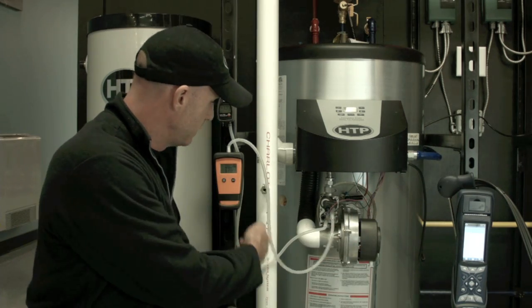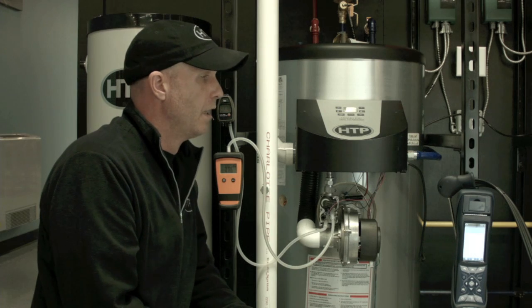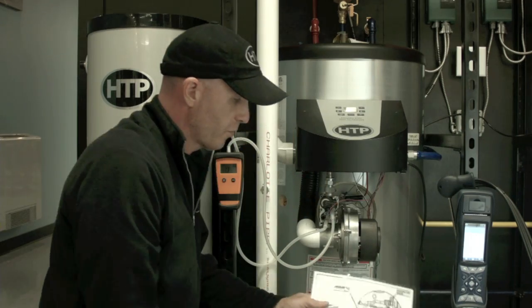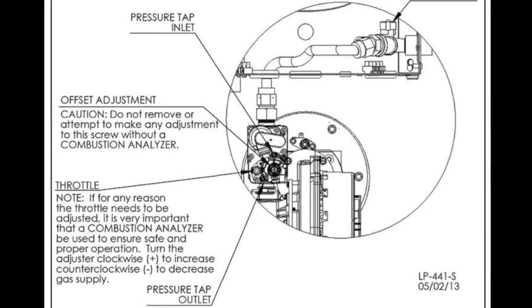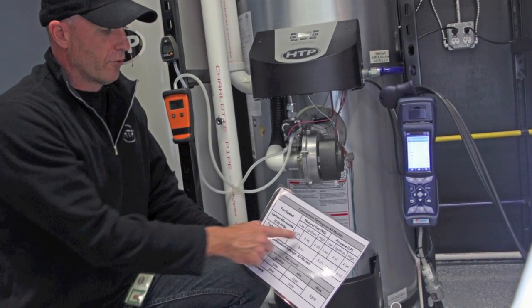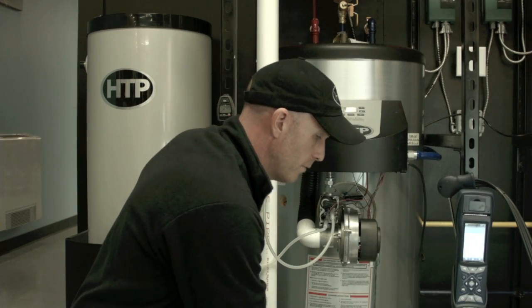What you don't want to do is have the analyzer set into the exhaust before you have established combustion. You can sometimes flood the analyzer and send it into an error, and then it's going to be difficult. I've also printed off a copy of the layout of the gas valve that's contained in the manual, and you can get on your HTP app. For this natural gas unit, I have my fan speeds and combustion levels that I'm looking for. We need to be well under 20 parts per million on CO in high fire — pretty close to zero in low fire, one to ten. The CO2 range is eight to ten percent both low and high, which means there's not going to be a huge change between the two — that's typically what we look for.